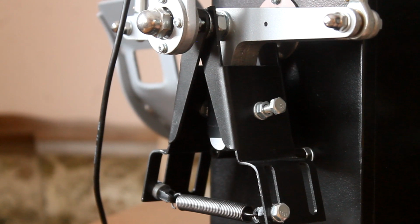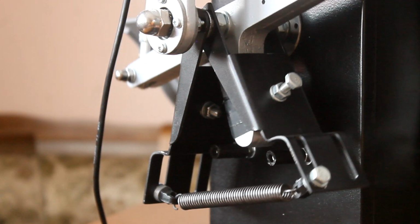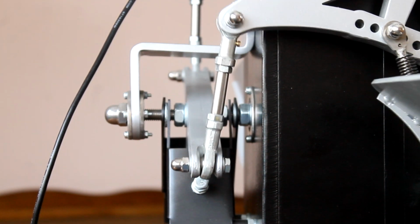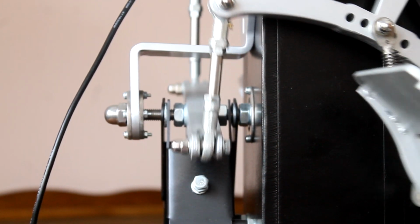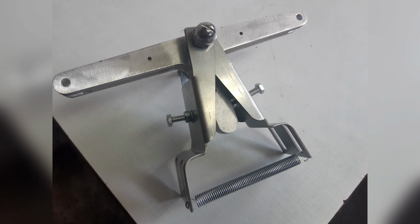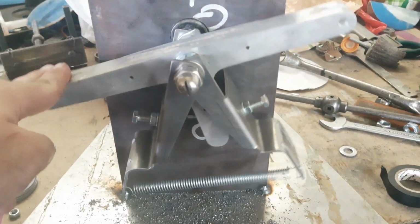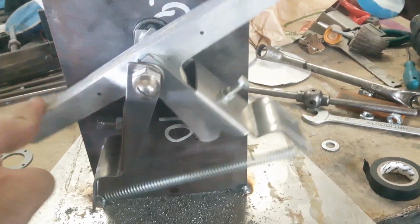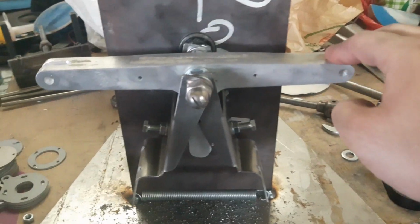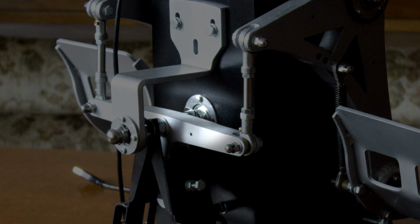Both of these have a hole on the side through which a screw is placed. The screws are adjusted so that the parts are always connected. Everything is then placed on the axle. The T part is bolted so that it moves with the axle while the surrounding parts can rotate freely. As the entire mechanism is leveraging on a single bearing, there was a slight wobble initially.